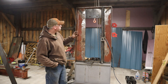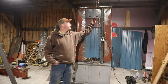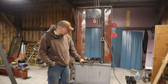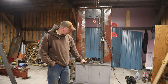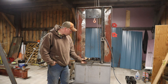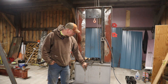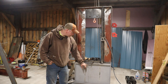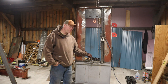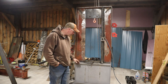To recap: we have an inch worth of steel here all welded together — our two-by-two square tube — and two and a quarter inches total for the bottom die block. That's a one-inch plate welded onto an inch-and-a-quarter plate, two-by-two square tube with quarter-inch wall. On the back side we actually have part of an I-beam that goes all the way down and is welded solid.